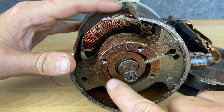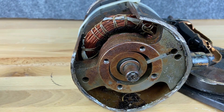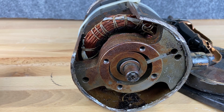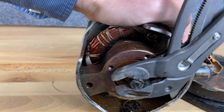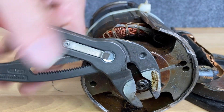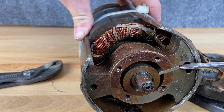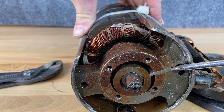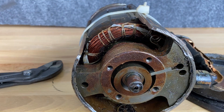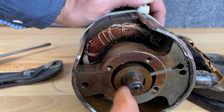As this turns, it starts squeezing through the discharge. There's going to be another hole right here discharging it through the top. We'll see if we can make this turn. The high pressure will keep this pin pushed in, separating the low side from the high side. Now we have the suction side coming in here and this is the discharge side.